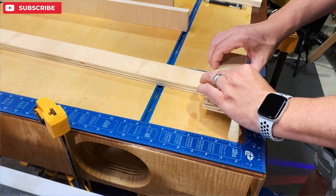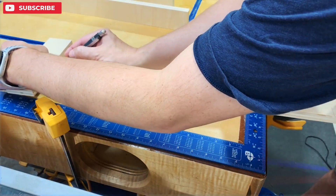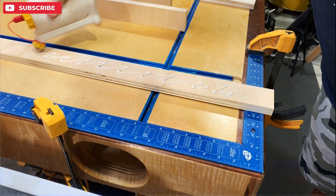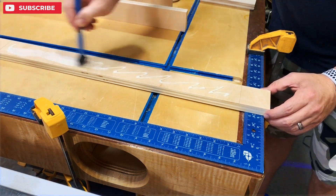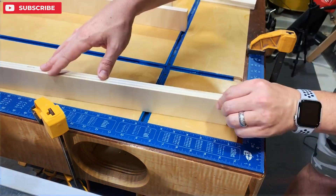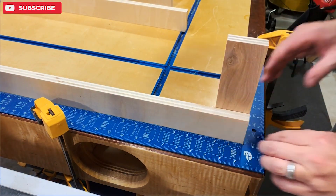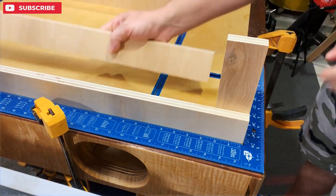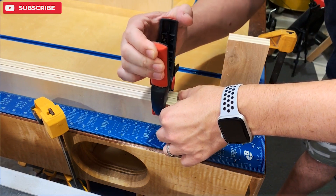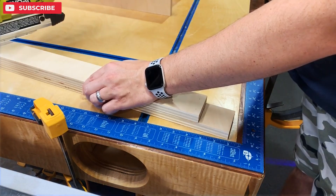Now on to assembly. I used a piece of my cutoffs and marked them on the ends so that I knew where to stop the glue, because you don't want to have glue inside the bridle joint. I used a right angle here so that I could line my pieces up. I used that same spacer to line everything up so that the distance would be equal on each side and I'd have a nice square bridle joint when done. I used pin nails throughout just to temporarily hold it all together before getting it into the clamps.